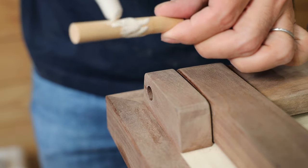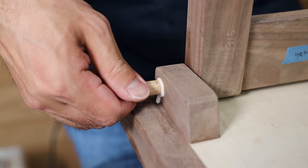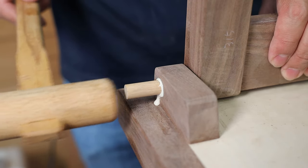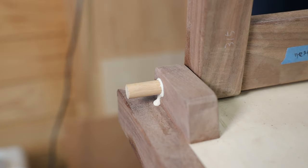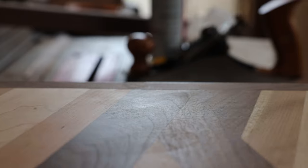Secure the hinges. Don't apply glue to the leg area. The center of the tabletop is a high spot, at the same height as the trim. Both ends of the tabletop are low spots.